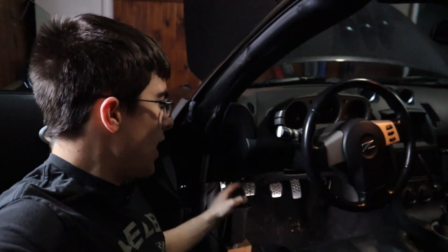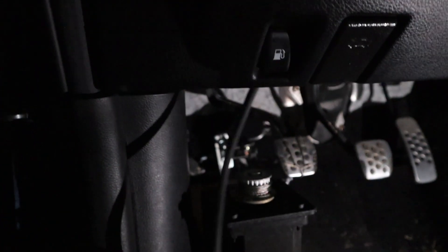Lastly, we'll take a look at the actual stepper motor. It has this black cable — this is where all those wires were running from the stepper motor driver on the inside. I color-coded those specifically to match what's coming out of the stepper motor, because each of those wires does have a different function. You can't just plug any wire in wherever you choose on the stepper motor driver. The stepper motor and driver should have diagrams showing where things need to go, and if you look up Arduino stepper motor driver resources there's a lot of helpful guides online — let me know in the comments if you have specific questions.